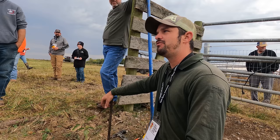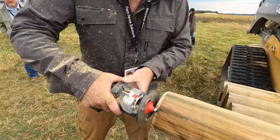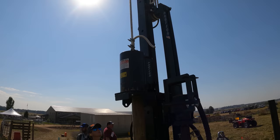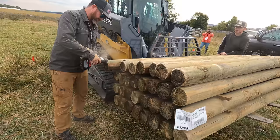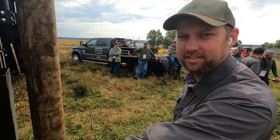I'm Robert Littrell with Sticks Fencing. Today we're going to be teaching you how to do Kentucky four-board fencing using Kentucky or American Timber and Steel posts and poplar boards. Justin here is rounding off the ends of the post, because when the post driver hits a post that's a little bit dry, sometimes they can splinter out to the side. But just routing off this end right here will prevent splitting in a lot of cases. I'm Ryan Sluke from Sluke Fence in Mount Olive, North Carolina, here at the Fall Fence Forum.